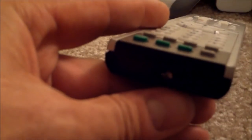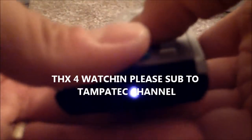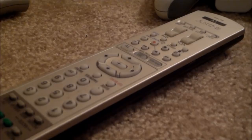Again, use your digital camera to see if you don't see that white light with your naked eye. Use the digital camera so you can see the light — your human eye cannot see infrared, you don't see that light spectrum. Use your digital camera on your cell phone and you'll be able to see it blinking like that. Thanks for watching, post a comment, and subscribe to Tampa Tech. I'll see you next time.